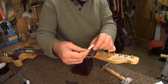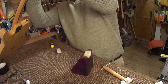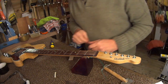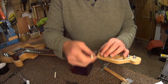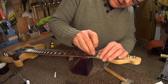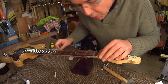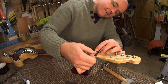It's still not quite a square bottomed, excuse the expression, square bottomed hole. It's a shame because you never get it to look absolutely perfect. That's what we really want. First of all, that's never perfectly square. It never gets right into the corners, which is the frustrating bit. I'll try my best to square off the corners. So just cleaning any glue out that's built up right in the corner that stops the thing sitting, or the angle I should say, not the corner. Alright, just about there. Yeah, good.